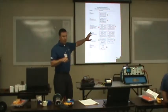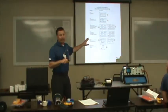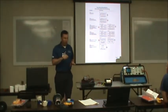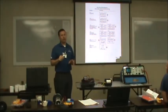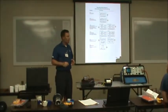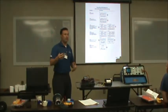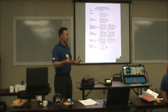All right, that's pretty much covered your basic motor connection. We're going to get into Y delta. Anybody in here ever dealt with Y delta motors? Or part winding. Y delta motors, I probably get more calls on this than I do anything else. How do I hook the motor up? It's called Y start delta run. They start the motors on a Y connection because it's a little bit easier to start, when you don't pull as many amps. When it gets up to speed, we switch it over to delta.